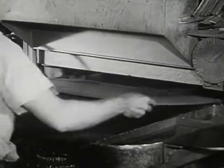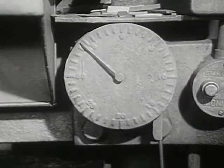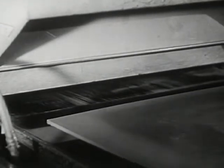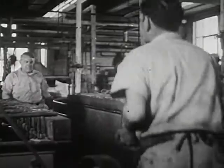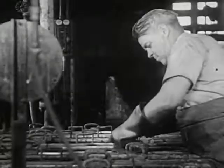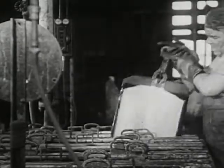This operator covers the lines and pages with a plate of wax, then pushes it into the press. Down goes the press, and out comes the wax plate with all the pictures and letters pressed into the soft wax. Next, another worker dips the wax plate into a large tank which has copper in it. The copper goes into all the places where the letters have pressed into the wax, and it forms a solid plate. It has the same letters and same pictures as before, but it is much stronger.